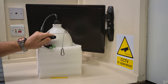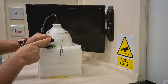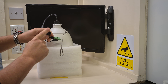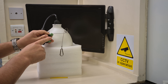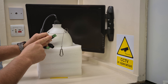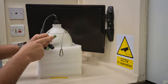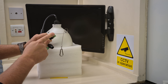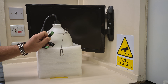It also has, because it's a network camera, the female RJ45 connection for the picture to go down, and it's PoE so it can take its power down that cable too. If you don't have a PoE injector but just have Cat 5 or Cat 6, there's a two-pin plug here with male and female for 12 volts. There's also a three-pin plug for audio in and out, and a ground connection. You can plug a microphone in, hide it in the arm, and if you've got outdoor speakers on a big commercial property, you can press a talkback button on your mobile phone and shout at people through the speakers — scare them half to death!